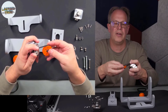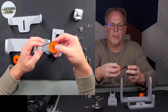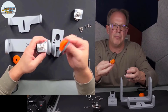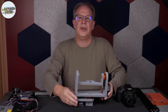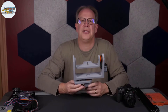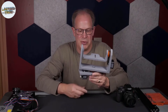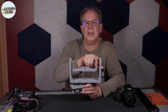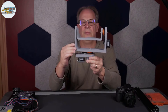I want to do a belt drive on this. I've seen and tried other ones that have just a gear with a tooth, but I didn't feel they gave me as many steps and as much tolerance in the rotation. So I felt a belt drive might be a little bit better. Now that I have everything assembled - it took a little bit of finesse, and as with 3D printing you may want to go back and make tweaks - I'm very happy with the way it's come together. I have my motor spindle for the tilt and the same setup in a slightly different configuration for the pan.